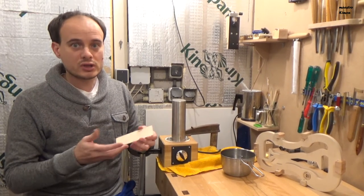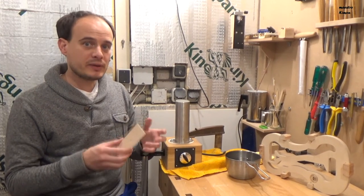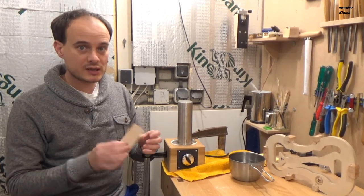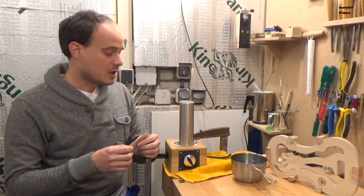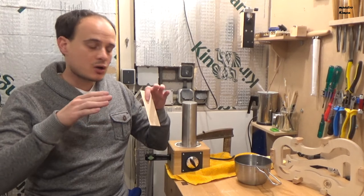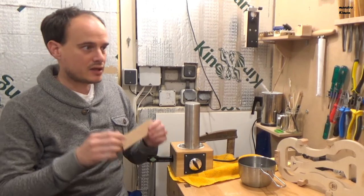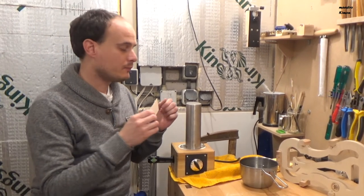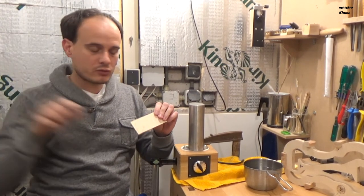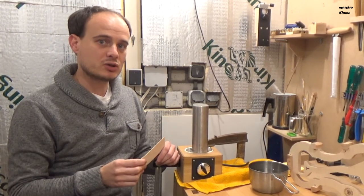The water helps it to become very hot but not to burn. The bending is a very tricky procedure. It is very easy to break the ribs — they are only 1.2mm thick — and you want to have a very nice flowing curve which follows the curve of the C parts. I don't have to bend them back and forth a lot of times because then I will get a wave instead of a nice line. That's it, let's go, let's see how it goes.